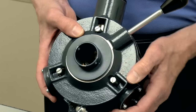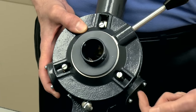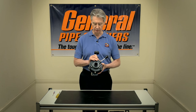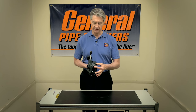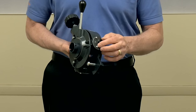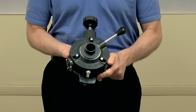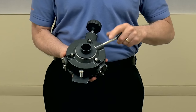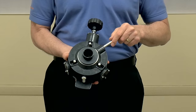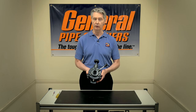The power feed has three roller bearings — at the 12 o'clock, 4 o'clock, and 8 o'clock positions. The easiest way to get out the rollers is through the discs at those positions. Just unscrew these and then unscrew the swing pins. The swing pins are the piece that actually allows the power feed roller to pivot and feed the cable in and out. Then you'll find that the whole carrier will come out in your hand.